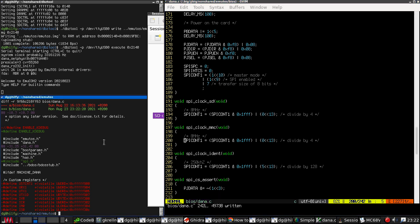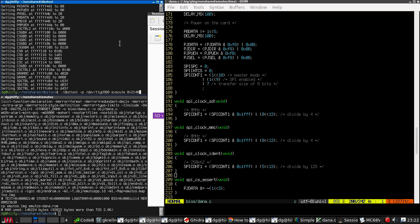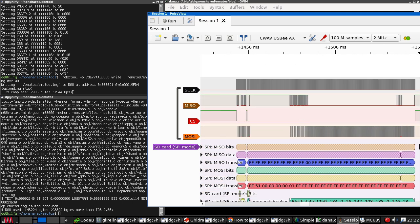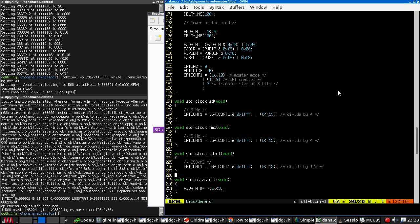I need to do this. Need to test this first. I'm not entirely convinced that my changes to the SD card stuff, the SD card logic, is right. But it is very suspicious that it's not twiddling CS between commands, because I'm pretty sure that the card needs it. SD cards are picky as all hell, and it's possible whoever wrote the original code for EmuTOS simply had a card that was a bit more easygoing than mine. But you do have to do everything right, and I trust the Fuzix code because that seems pretty solid in my experience.